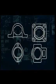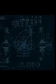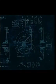Y-bearing units, because of their simple, robust design with excellent sealing, are to be found in agricultural equipment, screw conveyors and fans, where the loads are relatively light and speeds moderate. It's important to realise these bearing units have no axial freedom.